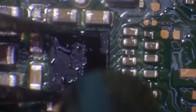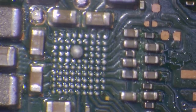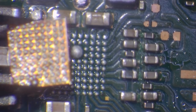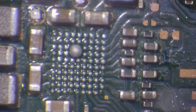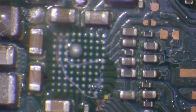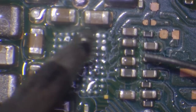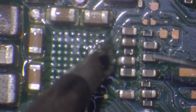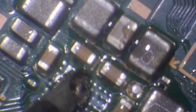I'm going to add some flux. I don't know if this chip is going to be good or not, so I don't think I should try and re-ball that one — it's going to be a waste of time. The chip in question I'm attempting to replace — the reason I'm replacing it is number one, it's been reflowed in the past, and number two, from what I remember of the microSD card circuit, power does come from the Max 77620A chip.